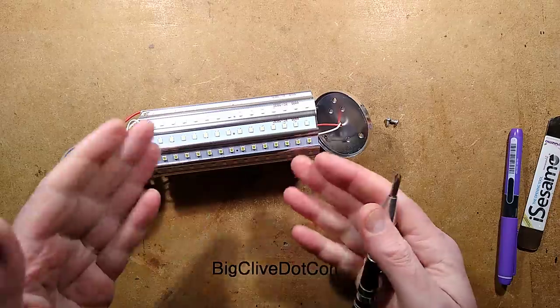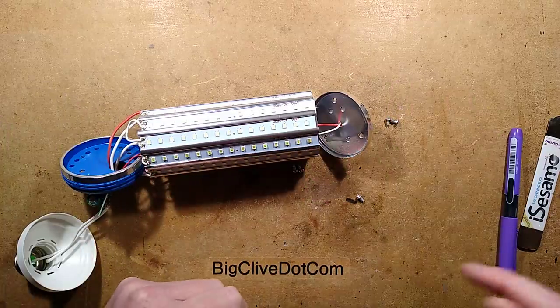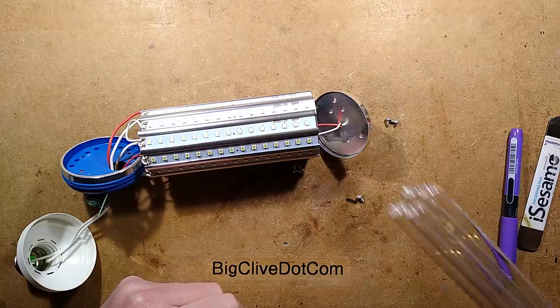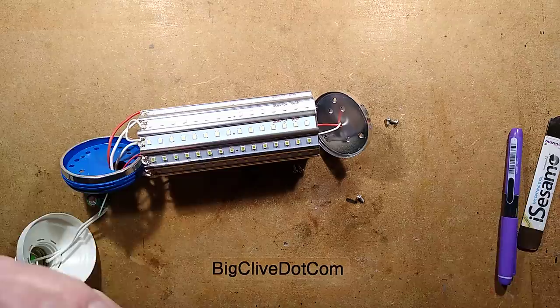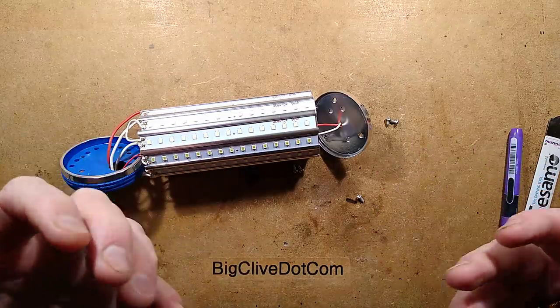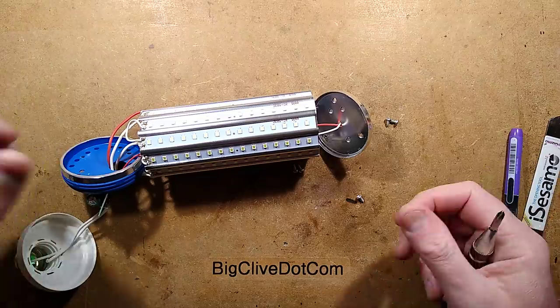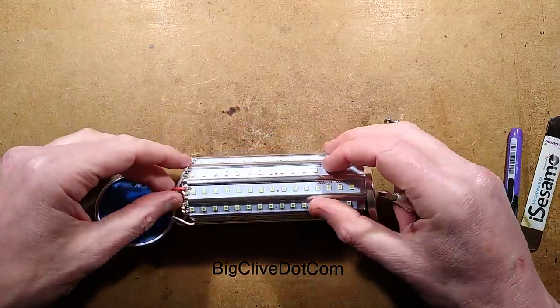They may say, oh, I had one of those and you could just go in the room and it was absolutely fine. But then they end up getting a real UVC lamp and they go into the room and hang about, and then they're going to really suffer because, as I say, it causes damage to your eyes. It heals up after a while, but you wake in the middle of the night and it feels like there's sand in your eyes. It's what welders get when they get exposed to arc flash.